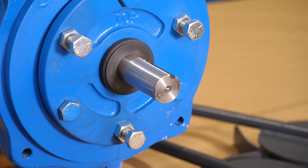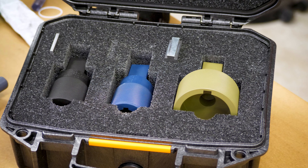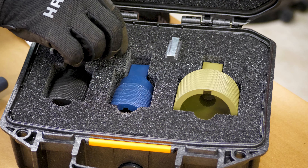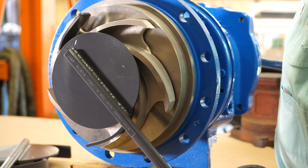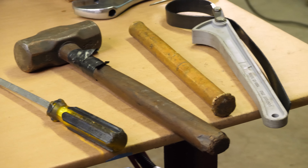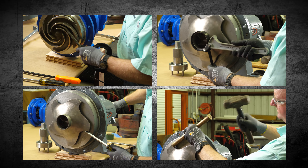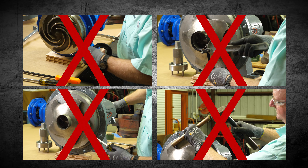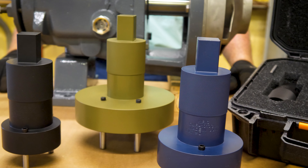There's been no damage to the critical components of the pump. The Key Risk system provides the proper tool to safely disassemble and assemble your ANSI industrial pumps. It's specifically designed to distribute pressure evenly to the impeller, allowing even the tightest fitting impellers to be removed without damage. No longer will machinists need to use inferior tools which can cause damage and distort the impeller or pump shaft — damaging these critical components leads to imbalance and vibration issues which cause premature pump failure. The Key Risk system is the right tool for your job: it's safer, easier, and cost effective.